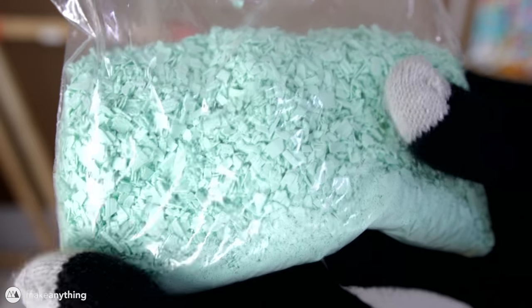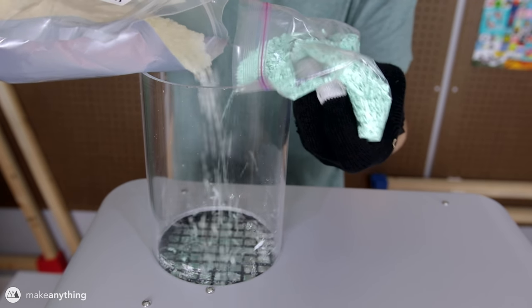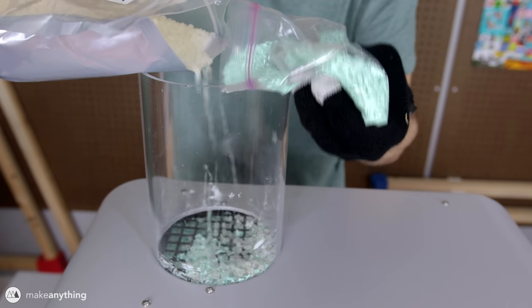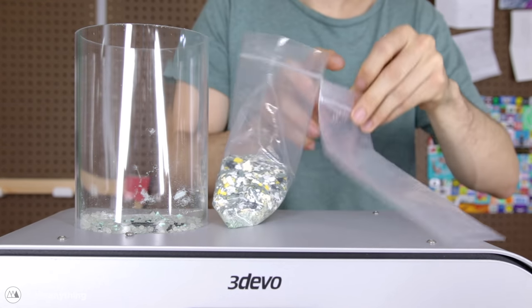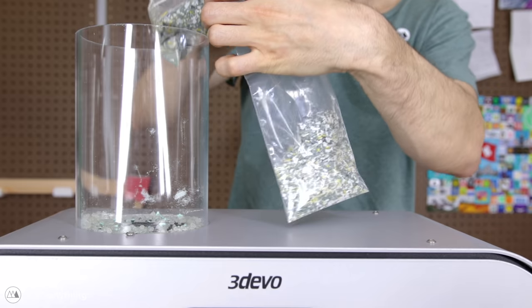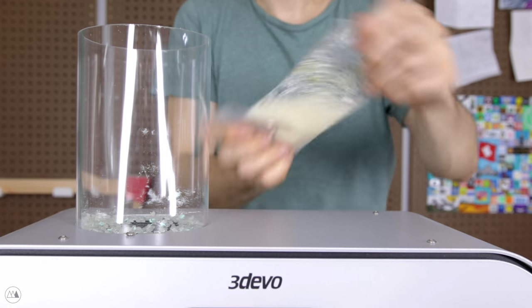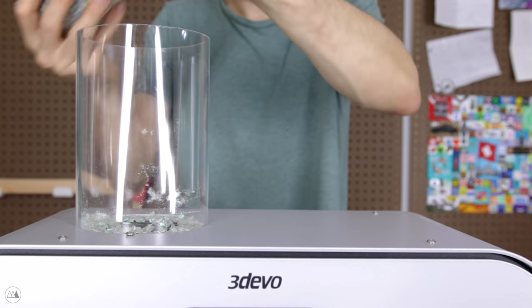Let's try adding some crushed up support material made from Filamentum's mint PLA - it's already a lovely color, so it'll be interesting to mix it with some raw granulate. I decided to add both the raw plastic and the virgin granulate to the hopper simultaneously, eyeballing a nice 50-50 mixture. Then I decided to also try a mixture of all kinds of different failed prints. To get a better mix, I pre-mixed it in a bag with some natural PLA granulate, then shook and mushed it until it looked evenly mixed.